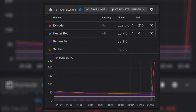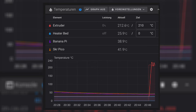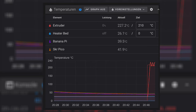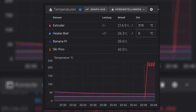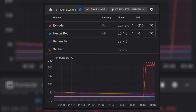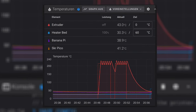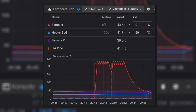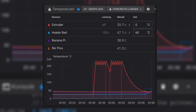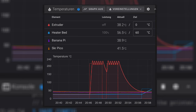Now that the platform has been leveled, we have to verify its alignment. To achieve this, we have to be able to print. In my case, I'm using a THC Pro hot end with a powerful 115 watt heater cartridge, which exceeds the standard heater cartridge specification that is defined in Klipper. As soon as I would start the print, I would get high overshoots resulting in burnt filament or even a clogged nozzle. To prevent this, it's crucial to perform a PID tuning.